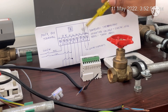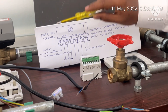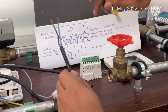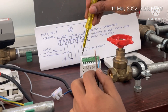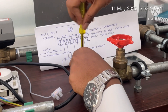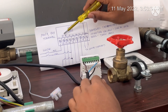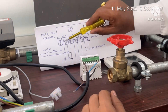This is the power box terminal of the thermostat. According to the power diagram, I am going to connect the cables. First, you can see terminal L — the phase cable will be connected here. My power cable has blue as neutral and brown as phase, so I am going to connect the brown cable to terminal L.